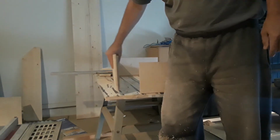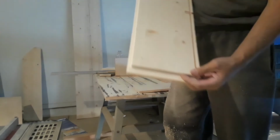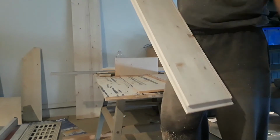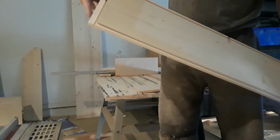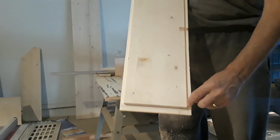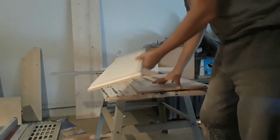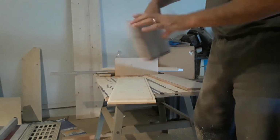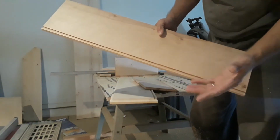Alright guys, I've been recreating drawers, and I've got this piece all cut out. I used my table saw to cut out the pieces, and I used an old drawer face as a guide. And I've cut the sides out. I've cut the bottom part out where the bottom board is going to be. And I cut it out around all the pieces, all four pieces. And here is the back side, just like this. And now I'm going to assemble them.